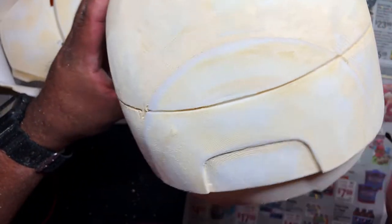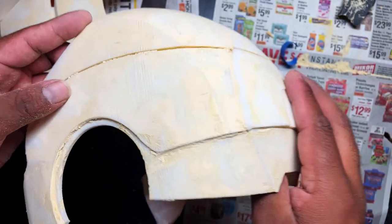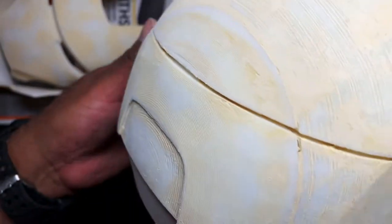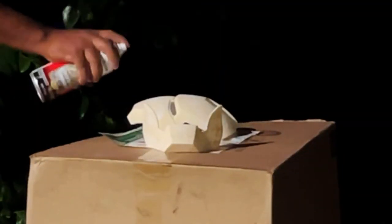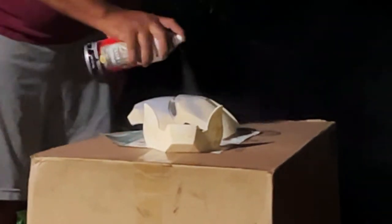As you can see, I had already started with the wood filler and already started sanding this down. That little piece I had to put back together is looking pretty flush with the rest of it, but we still have a lot of work to do. We're going to do more wood filler, more sandable primer, back and forth until it's nice and smooth. You want to recarve all the lines that got filled with the wood filler — I'd suggest doing this wet instead of waiting until it's dry. We're going to use some sandable primer and cover all the pieces, then sand again and repeat.